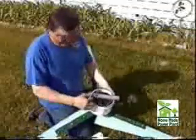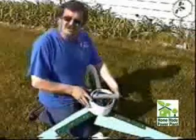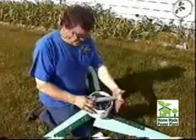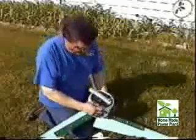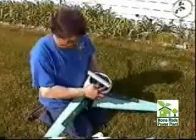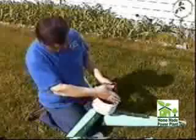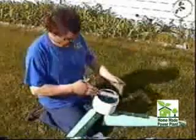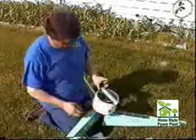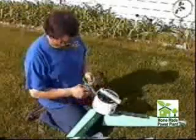Next, I cut a piece of 1-inch galvanized pipe from the hardware store, a little bit longer than 6 inches so it hangs out. This is what you're going to mount it on on your pole when you're all finished. On the alternator, there's a mounting bracket with threads in it on the back — a hole. Lay that pipe across the alternator, shim it up so it's nice and smooth across and straight. Make it stick out on one side about an inch and a half or two inches, and keep the other end inside the tube. Bolt it down tight.